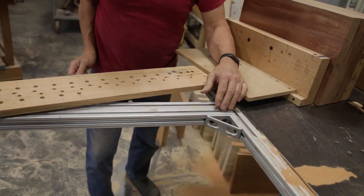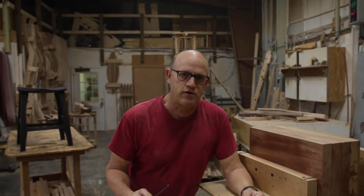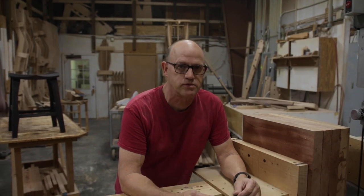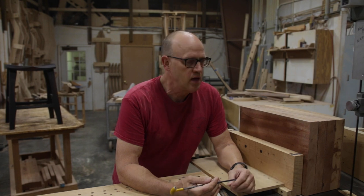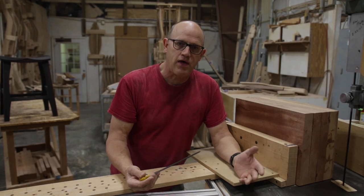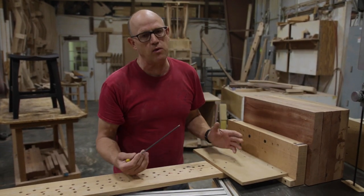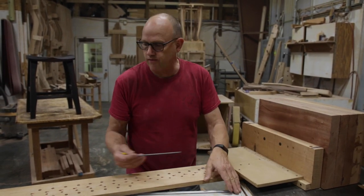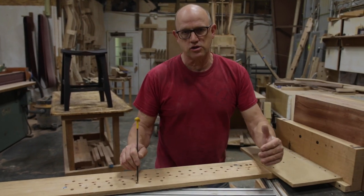There's a lot of debate about the existence of drift. I don't understand why there's any debate about it — we've demonstrated in this shop many, many times what the importance of paying attention to drift is. Drift is the direction that the saw wants to cut, and if you don't follow that, you're not going to get an optimal cut. You saw the cut we just got — it wasn't bad, but I got a little bit of burning. I'm going to minimize that by shifting the pivot point, which changes my orientation to drift.